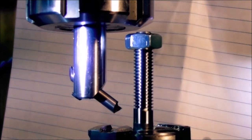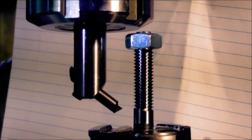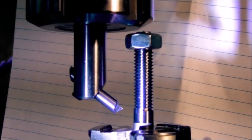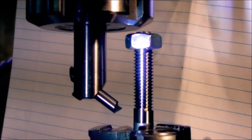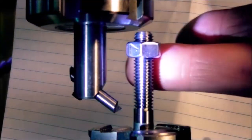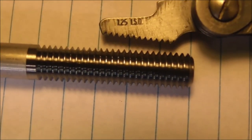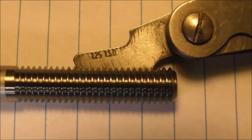Here I'm cutting an eight millimeter metric thread — one cut to full depth, that's 0.78 deep and 31 millimeters long. I'm still using the same hand-ground fly cutter, just off-hand ground to that 60 degree included angle. Once I've blown off the swarf, the thread was silky smooth and the nut just spun on. I'm really pleased with the surface finish of the thread, the thread form, and the pitch accuracy.